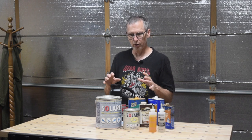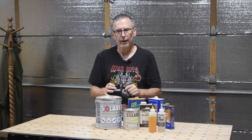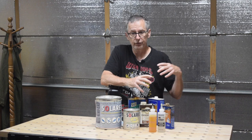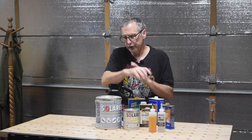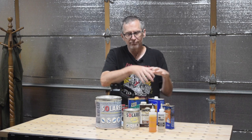Over the years I have developed an affinity for certain specific products, and with these products that you see here, I can accomplish just about any kind of finish. If I'm going for a deep mirror-like high gloss sheen on my clear coat, I like to use Crystal Lac Brightone Instrument Finish. It's water-based, there's no odor, it won't explode or burn down my shop, and I don't have to worry about disposal. It's really easy to clean my spray gun and equipment. Typically that's what I will reach for — whether I'm doing a high gloss mirror-like shine or a satin or matte finish — because Crystal Lac also sells Brightone with those different sheen levels. If I was going to say I had a go-to product, that would probably be it.